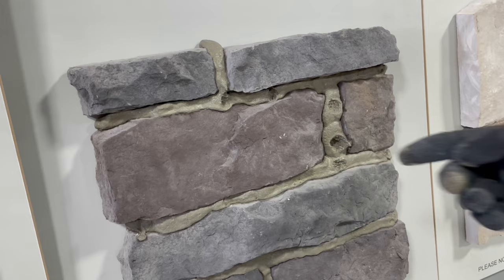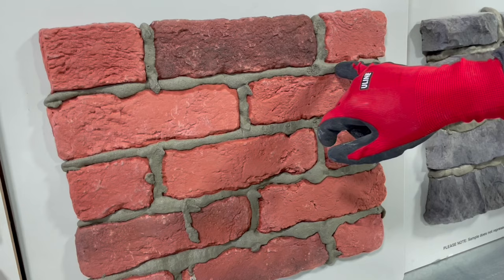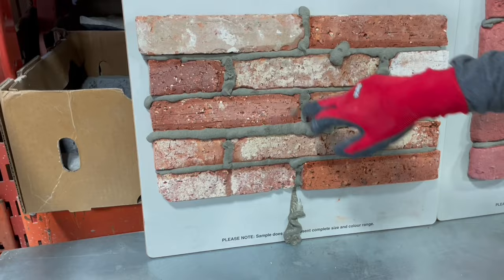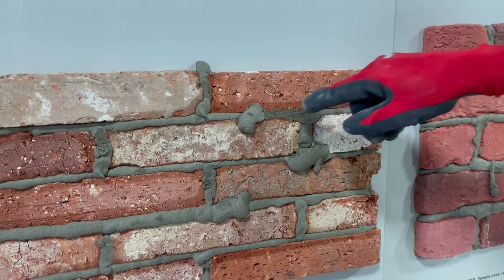This one is almost ready - I can't get my finger too deep; it kind of doesn't push the grout out to the side. And this one should be ready to go - yes, you can see you can't really push your finger in, it's giving you resistance. You can even do a little test clean and see what just flakes off - there's no wetness, no smearing. That's what you want to see - this one is ready to clean.